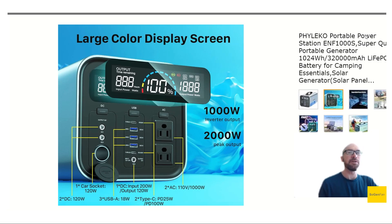Unlike my Ampro 300, which only had a 300-watt inverter, this thing gets pretty decent specs: 1000 watts continuous and 2000 watts surge, so you can actually do a lot with this. If you get the right appliances for cooking and things like that, you can definitely find stuff below 1000 watts. What's interesting is you're combining this larger inverter with a fanless design — typically when you're outputting high wattage, that's when fans in most power stations come on really loud. But this thing can power big loads and still make no noise at all.